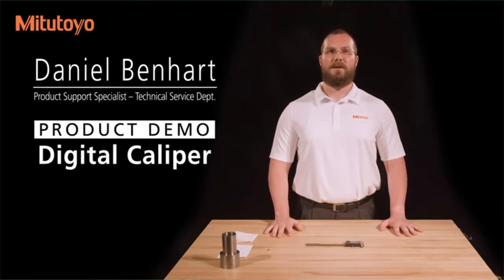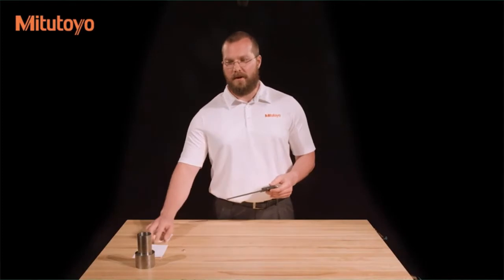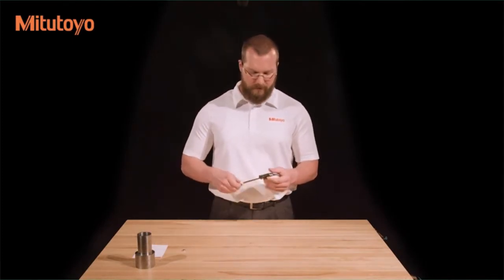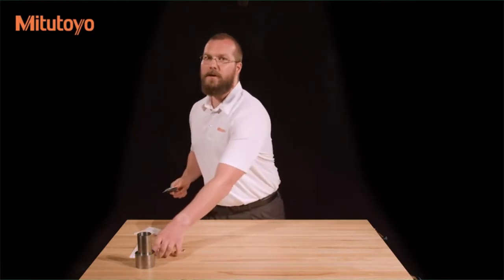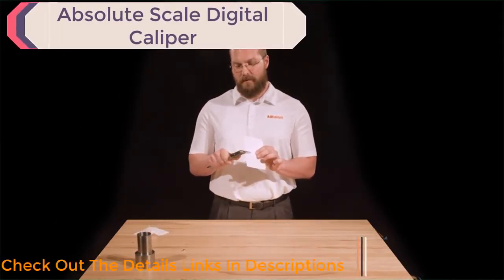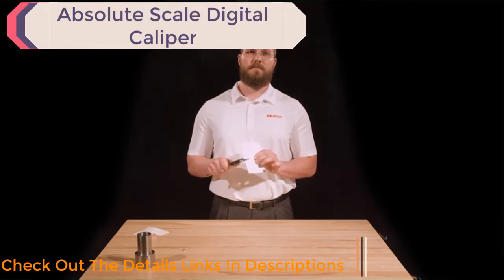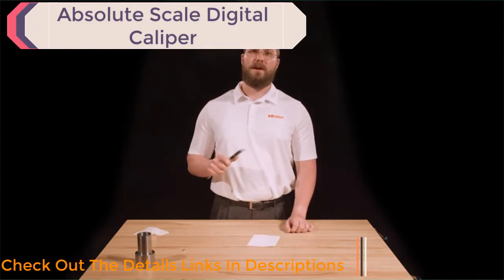In this video we'll discuss the use of a digital caliper. With a lint-free paper wipe, clean any dust off of the caliper. Place a piece of paper between the measuring faces and lightly close them without opening the jaws, then pull the piece of paper out from between them. This will ensure that both faces are free from dust and oil.